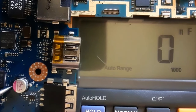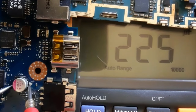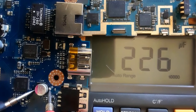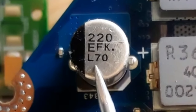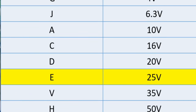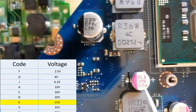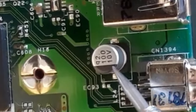Always you should respect the polarity of the capacitor, because it is a polarized component. We have about 220 — reading 226 — good, this is a good capacitor. For this capacitor we have 220 but no voltage printed, only the letter E. We should use the capacitance code table: E refers to 25 volts. For the other capacitor, the capacitance and voltage are printed directly.